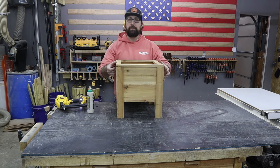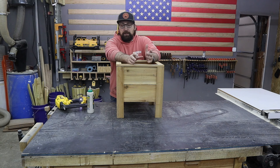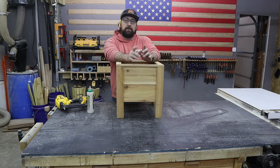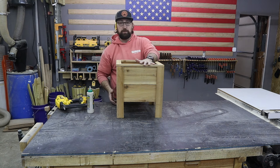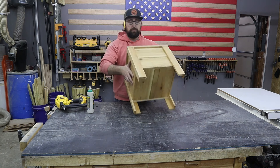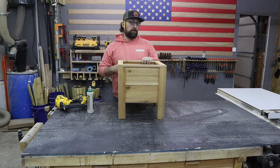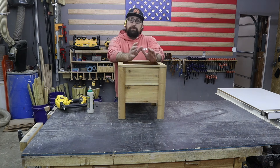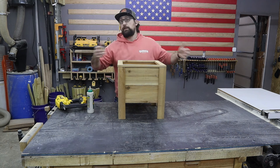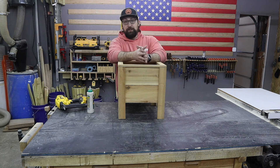Here is our finished planter. If you have some rocking, it's probably because of all the distortion in these pickets — they're meant to be a rough fence build, but we're using them for furniture. How we can fix that is go to the table saw, set your fence just shorter than the shortest foot you have — in this case probably set it to 16 inches. Flip it on its side, run it through, and it's going to cut all of your feet at exactly the same length. If this is a build that you liked, please consider subscribing, hit the notification bell, and let me know in the comments what future projects you'd like to see made out of fence pickets — bigger, smaller, tapered, tiered. Start off your comment with that so I know you got to this point in the video. My name has been Andy, this has been Cedar River Woodworking, and we'll see you in the next video.